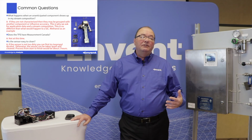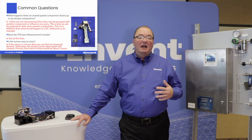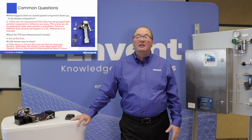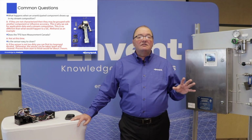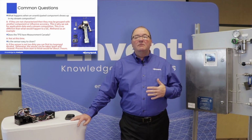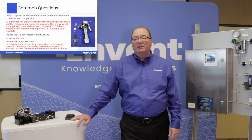So what we were able to do is actually characterize the sensor with methanol over a remote access through to the factory, so they actually could measure the percent levels of methanol and compensate for them. This is why it's so important that when you're considering this kind of technology, that we get a good background gas of what's expected and the components that you want to measure.